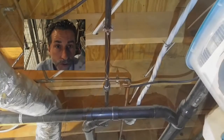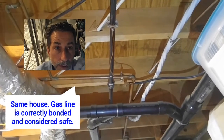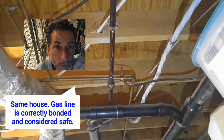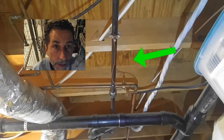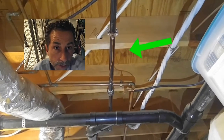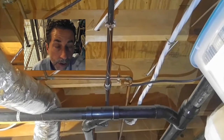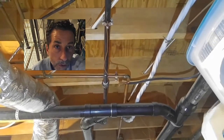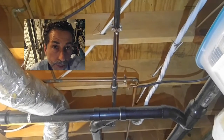The picture up here shows the gas line going to an appliance, and when you look at this particular one, this one is bonded. If you see the wires I have up there, there is one going from a water line, the copper line, over to the black iron pipe, which is the gas pipe, and that bonds it so that if there is a lightning strike, it gives it a way for that power, the surge, to neutralize, and it should protect the pipe.